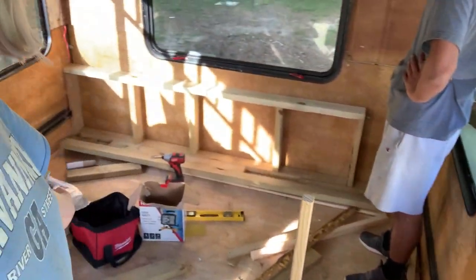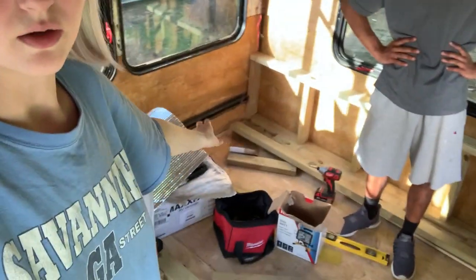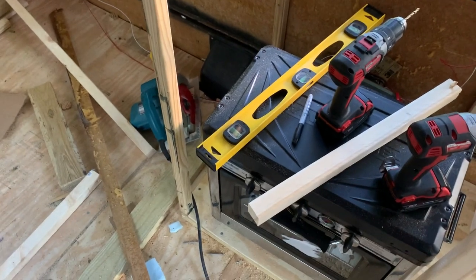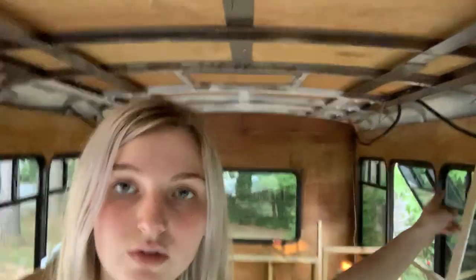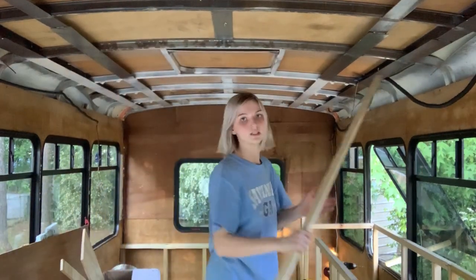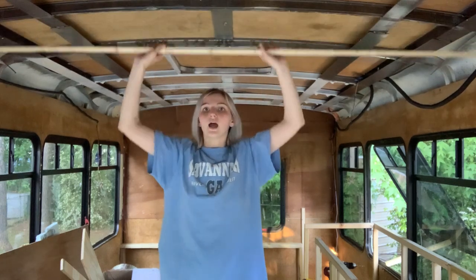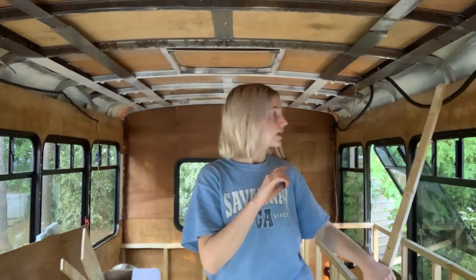So while we're fitting this piece in, we're also working on the bed frame. We finally got the back frame done, and then we'll make the box for the bed. We have just finished the basic framing. We still got all of these to put in, and we've got to put in the oven — I don't know if that's going to be today, because we don't have much daylight left and we're pretty exhausted after a few days working on this bus. Tomorrow we'll hopefully have it finished. What we're about to do is use the 1x2s and stretch them across the ceiling like this. I'd definitely recommend getting 1x2s — things flex real easily. So it would go just like that, then we'd screw it into the ceiling. We're about to cut each piece to length.